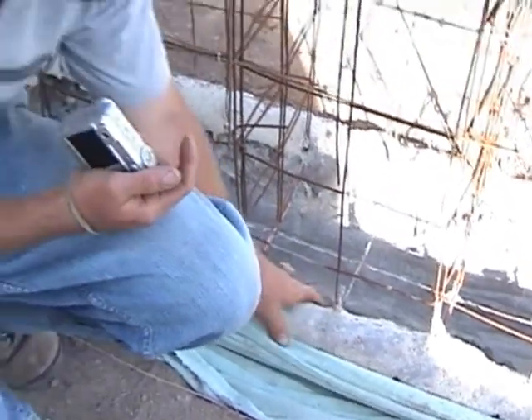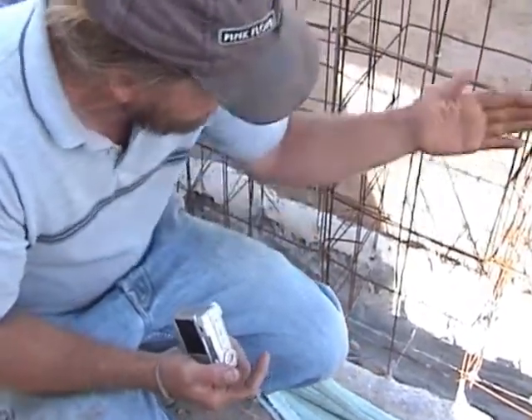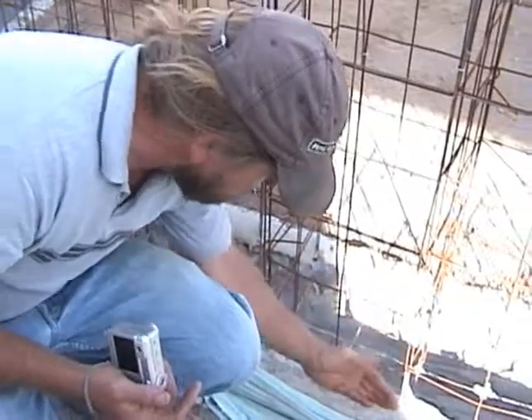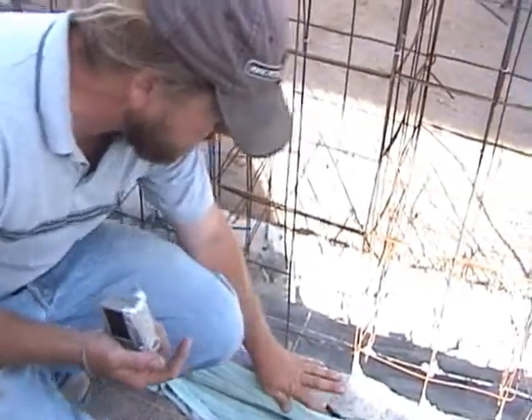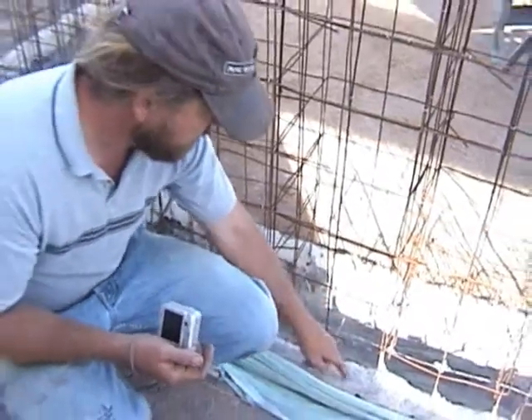This is a pretty thick, solid piece that can't break, and it's bonded very well. So when we come down with the surface plaster, it has a nice sturdy shelf to transfer that full load — something that won't break. That's why we took the extra precaution.